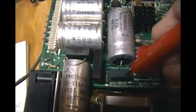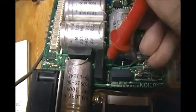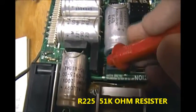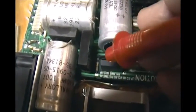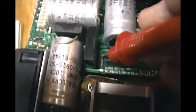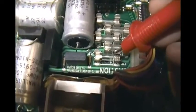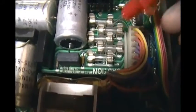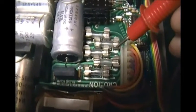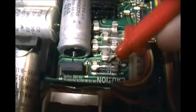I'm not going to be able to replace that if it's gone. I don't see how it could have zapped it, because it was not a huge spark — it was a small snap. This resistor is suspect, this diode is suspect. This is F-225, if I remember the number correctly — it's marked on the board but everything's upside down, and for me to turn this scope around would be very hard. But this fuse is good; all these fuses are good.